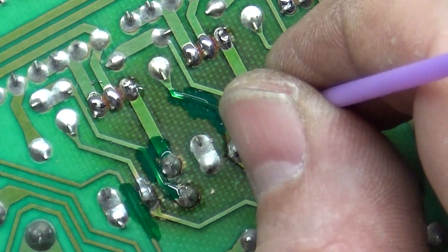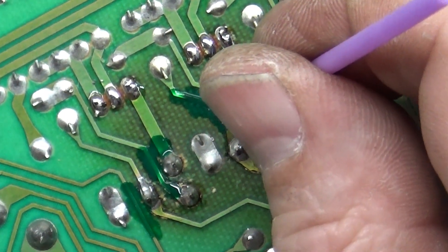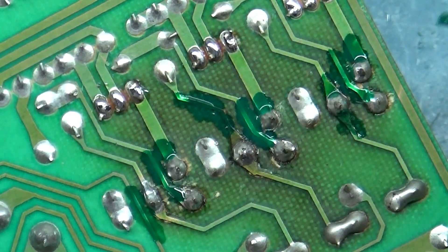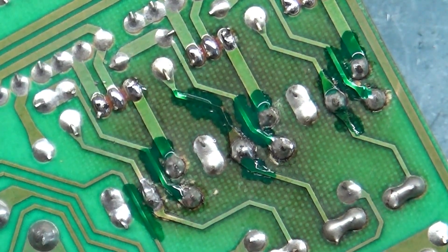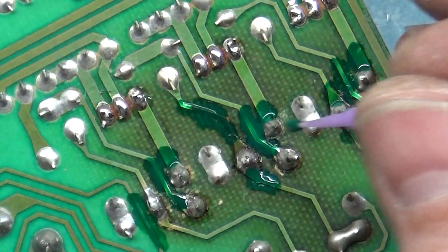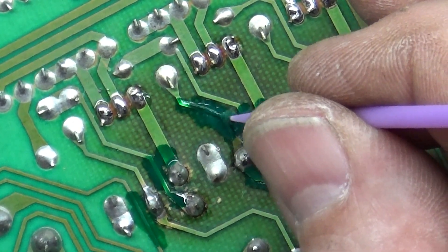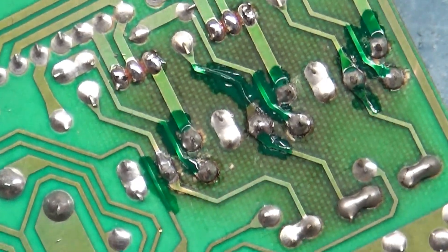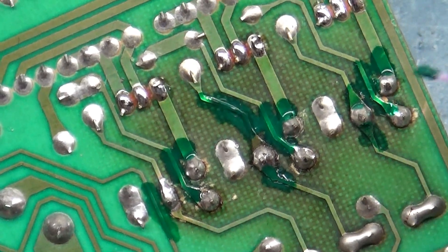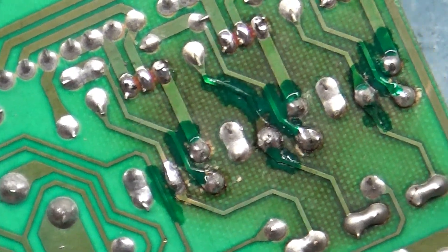You don't always have to superglue this stuff in place. Sometimes the solder mask here will do its job — once this hardens, it'll stay in place and you don't really have to worry about it from that point. Is that all of the exposed traces? I think that's all of them. When this dries, it'll look slightly better than this, but it's such a stark contrast because of the heat-damaged areas — I think that'll be okay.